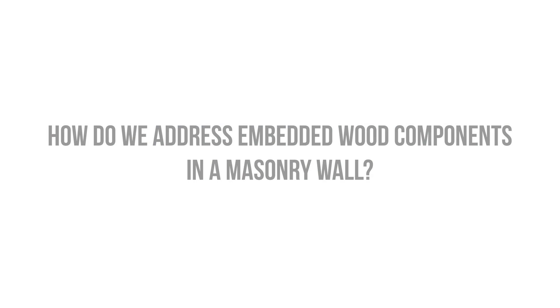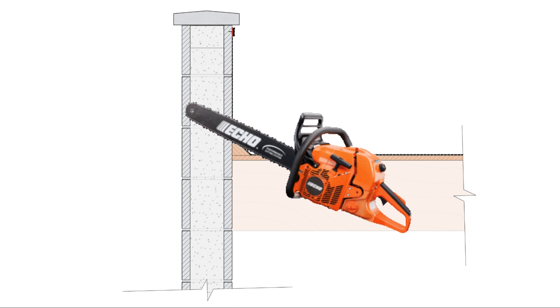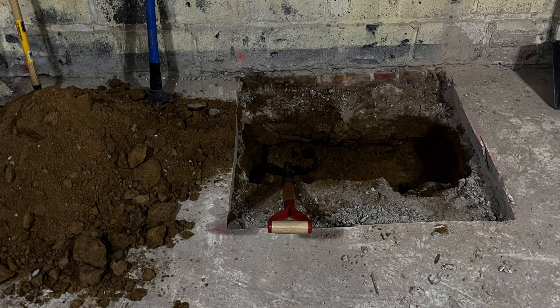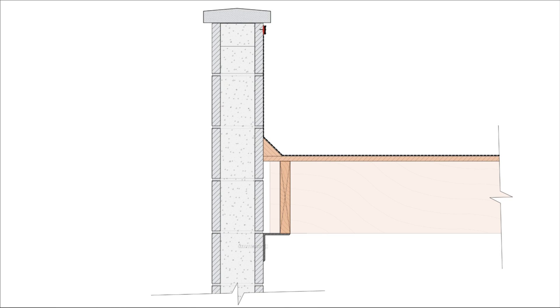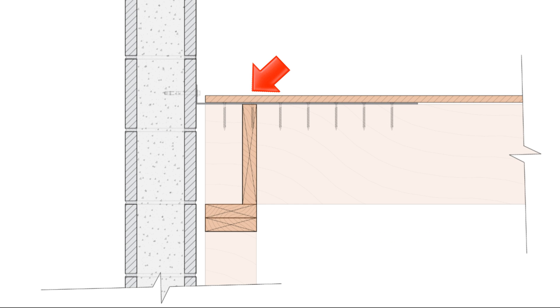When we come across a condition like this, we need to uncouple the roof framing from the block walls, which means cutting those rafters away from the block and providing a new bearing location. We can either install a new interior bearing wall — which may involve retrofitting new footings — or bolt a steel angle to the interior of the block walls prior to cutting the rafters away, so that they bear on the steel angle rather than being embedded in the block wall itself. We need to install anti-rotational blocking to prevent rafters from twisting, and we may need to tie those rafters back to the block wall with a restraining anchor. Coordinate all of these details with your structural engineer.